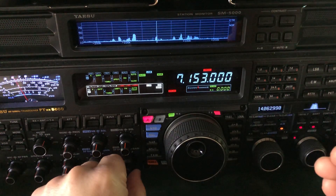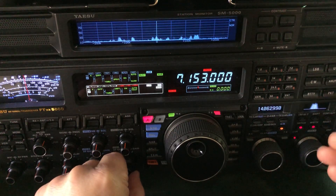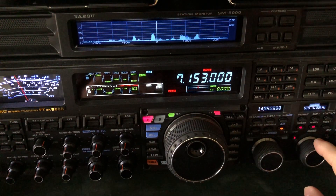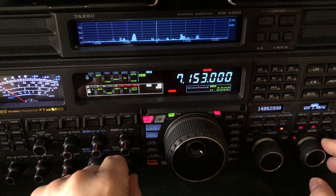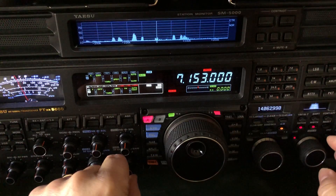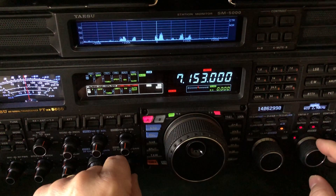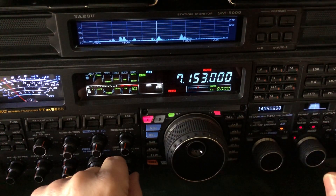Nobody owns the frequency — not even a net. It's just a ladies and gentlemen's agreement that we try to allow three kilohertz of bandwidth. And the reason for the three kilohertz is, like I mentioned in the previous video — there's three kilohertz of bandwidth. Hear how much better the voice sounds? It's not bad at 2.4, and even 2.1 is okay. 1.5 starts sounding nasally.